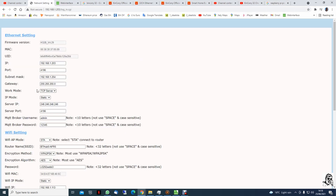Once you connect the device to your computer, you need to double-check what version of firmware you have. I will place links for the firmware downloads in the description. Once you upload the new firmware, make sure you have TCP server enabled — I've set mine on a static IP address. To access individual relays and turn them on and off, you need to get this IP address, type it in, and follow this URL structure.